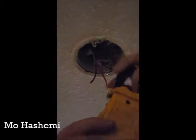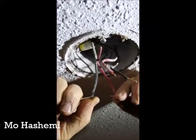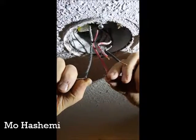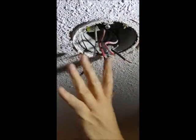The other two should show the end of line resistor — it shows 3.32 kilo ohm. So these two are from the end of line or the other devices, and this pair is from the panel.